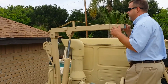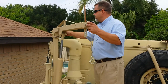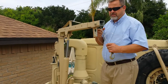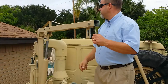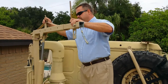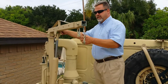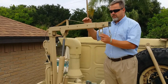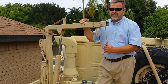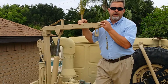It does slide out. You can pull the pin just like on any cherry picker. That's basically all this is, a modified cherry picker to extend it out to 4 or 5 different links on the extension with the cross pin. When you order this, it has a welded on tab so that you can use chains instead of using your cable. I think that from what I've used on this, you could probably use it more than the 2,000 pounds.